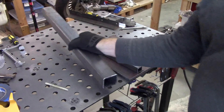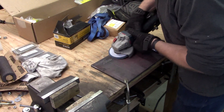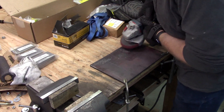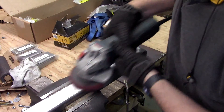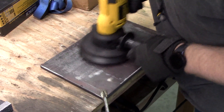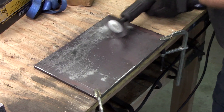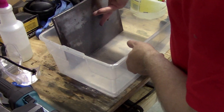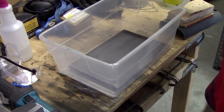The flat plate proved much more difficult to clean. I tried hitting it first with the flapper disc, which mostly just melts the mill scale and clogs up the disc. I tried one of these hybrid scotch-brite sandpaper polishing discs next, which didn't really do any better, but works fantastic on the bars. I tried more coarse grit flapper discs, a regular rotary sander disc, an abrasive nylon brush, a regular metal wire brush, and even just hand sanding — making virtually no progress with any of these mechanical removal methods. So I stepped back and did some research on how to remove mill scale.